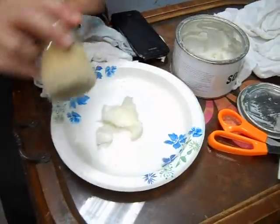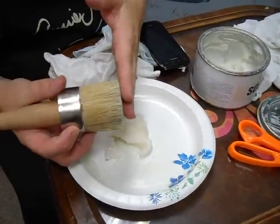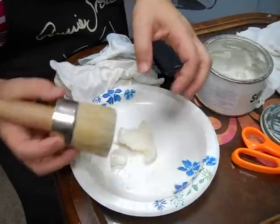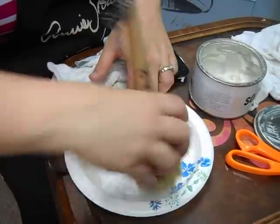To get some wax on your brush — because we want the wax to be applied very thin — you only want the wax on the tips. You shouldn't have it caking up the sides. And if you do, you probably have too much wax on your brush.